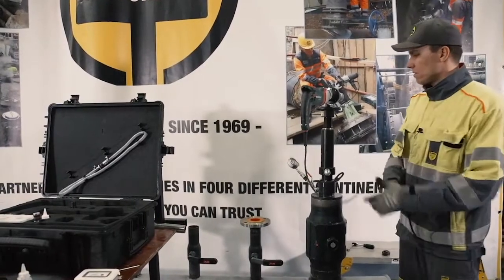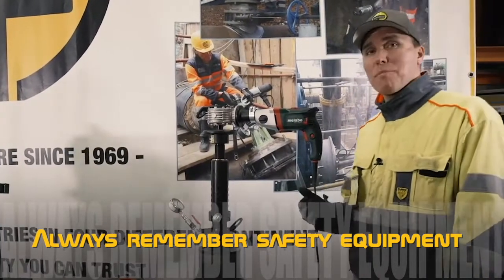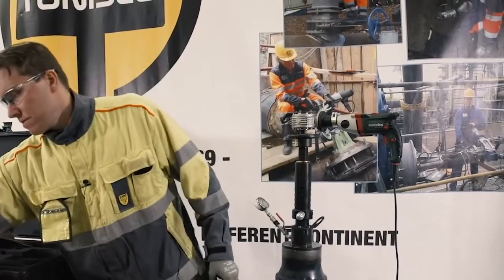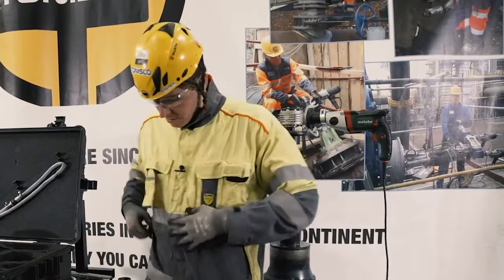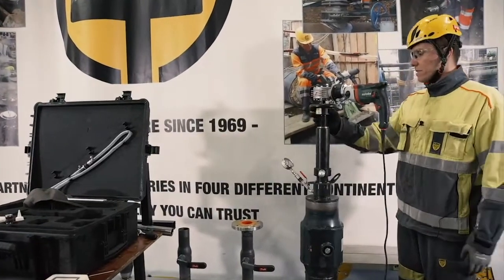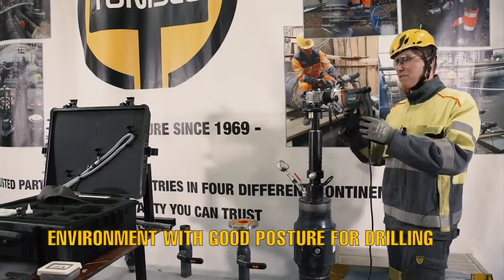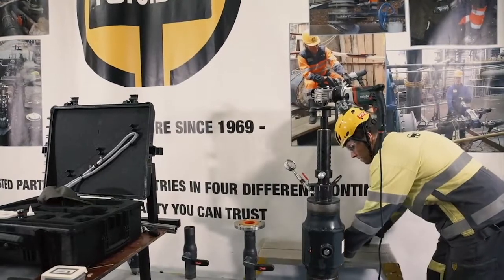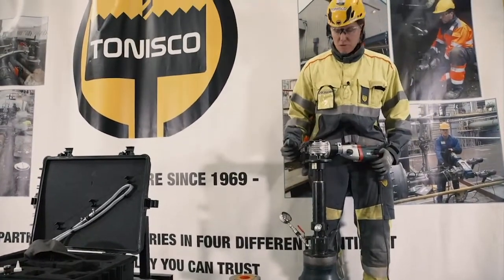Now we have the drive unit secured. Then we put on the electricity, but before starting to hot tap we have to remember to gear up and put on our safety equipment. We're going to take the eye protection and the helmet, secure the strap, and also earplugs if needed. Before we start, we want to make sure that we have an environment where we can start with a good posture. It's really important to have a good posture when holding the drive unit and feeding the cutter. Therefore always make sure that you find a good posture to hold the machine, because the turning motion will put some pressure on the drive unit, so you want to put counter pressure from your body.